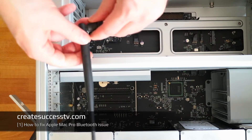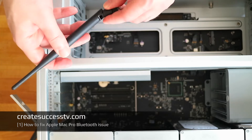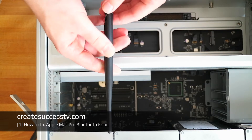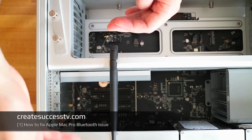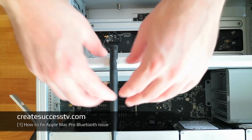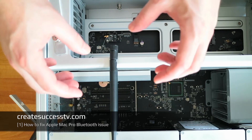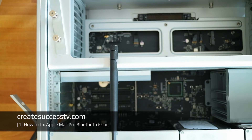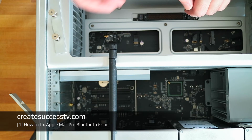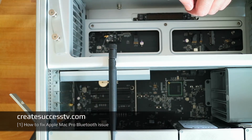Essentially what I'm using is just a different cable that goes to a normal WiFi antenna - this is a normal WiFi antenna that's also 2.4GHz, the same frequency as Bluetooth. You can use a WiFi antenna, but I would recommend not getting the one with the highest gain. Low gain antennas have a more bubble-shaped distribution pattern, while higher gain pushes the signal flat like a pancake across a large area. For Bluetooth, you want a roundish bubble around your computer where you're sitting, not transmitting into the next room. Stick with a lower gain antenna for round distribution, and get a long cable.